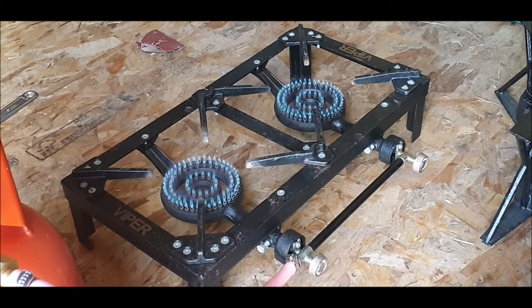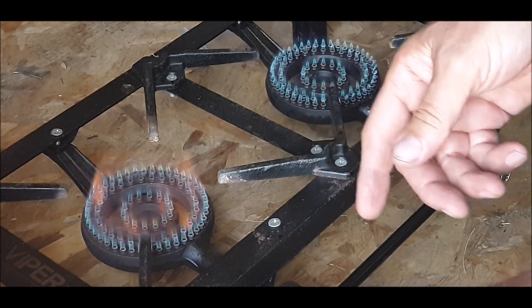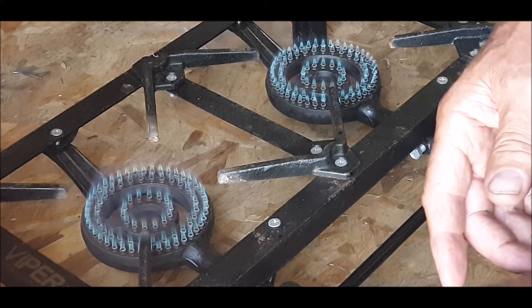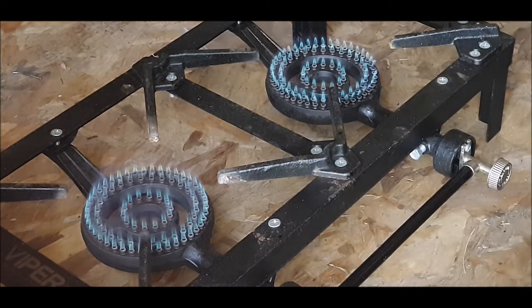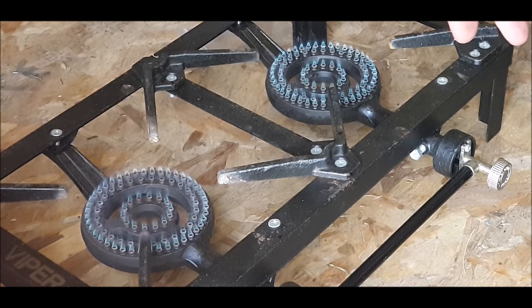You can see that if we zoom in. It'll take some tweaking — these screws here alter the flame. You can see it just changes the air. You need a good blue flame, so it's just a matter of getting adjusted with it, put both equal. Pretty good. Good cookers — 37 pounds off eBay. I'll put a link in the description below. I haven't done a full test on these yet; we'll do a cooker test on these.